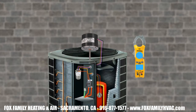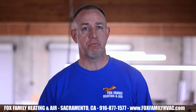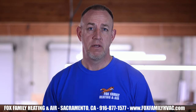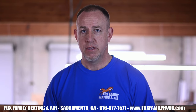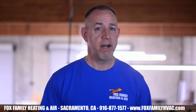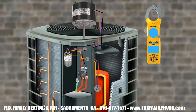Something you can check next is the line voltage at the contactor's load side — of course, with a call for cooling at the thermostat. Suppose your 240V system reduces to less than 200V when it's trying to turn on. Figure out what's going on there. Is it the wire size? A bad contactor? A bad wire between the contactor and the compressor terminal? But if these are good, let's move on to the next step.